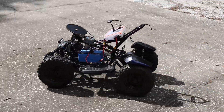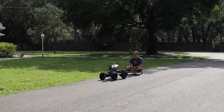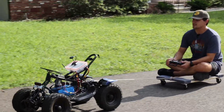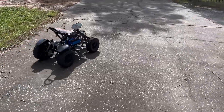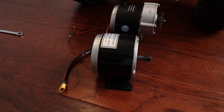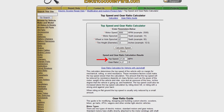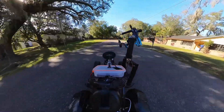ShipBot moves rather sluggishly right now. His motor has a gearbox with lots of torque — it outputs so much torque that he can easily pull me around. This is great if I needed him to haul something, but a robot you can jog away from isn't super intimidating. Luckily, this is a common motor type and there's a version without the gearbox. If the online calculators are right, this new motor will bring the max speed from about 5 mph to just over 27 mph or 43 km/h. Good luck outrunning that.